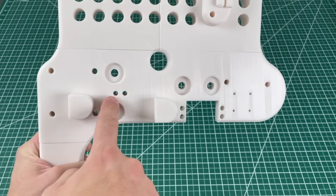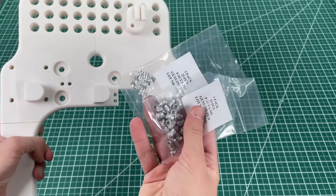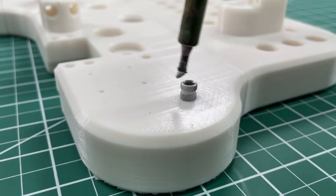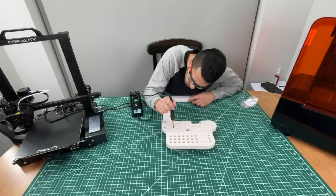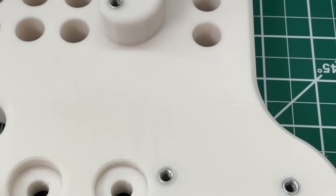We need to add some threaded inserts into all these different areas of the design. Let's add these threaded inserts instead of tapping into plastic. I'll just heat these up with a soldering iron and drive them in. If you want more information on this process, feel free to watch our DIY spot welder video where we explain this in more detail. I repeated this process for all the threads, which took no more than two minutes, and the outcome looks very promising.